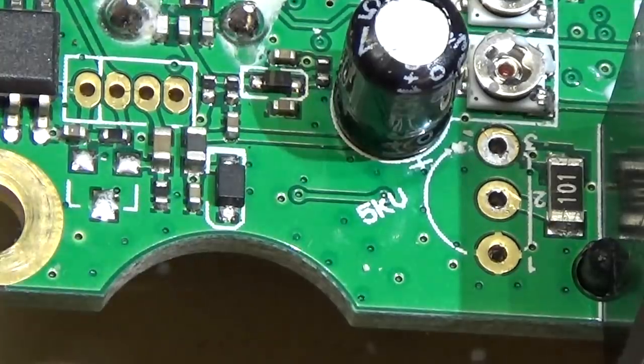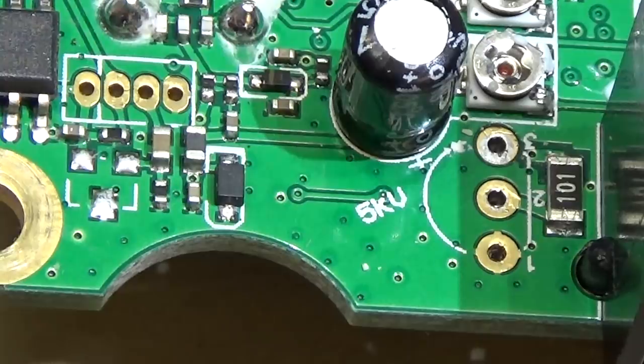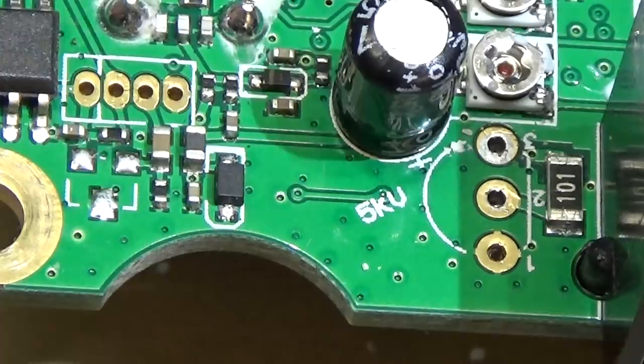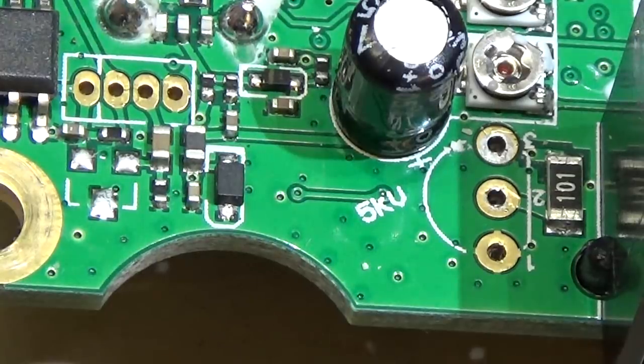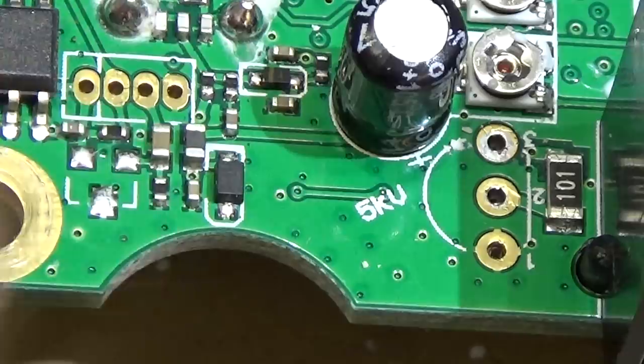And the only way to find out what's going on is to take it out and see if that component is causing the short. And if not, then all becomes a bit more critical, because then it might be that one of our most important ICs might cause the short, and that would be really an issue then. But okay, first let's take it out.